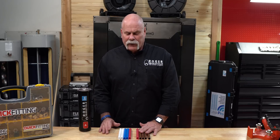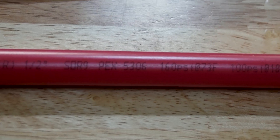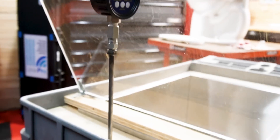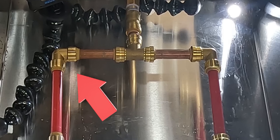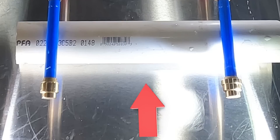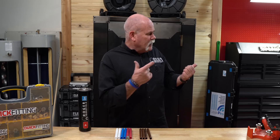The copper is already at over 1,000 pounds of pressure, and the PEX is rated at 160, so we're going to go way above that. We're not just wanting to test the pipe — we want to test two different brands of fittings and see how they compare. In our blast chamber we built a test rig. We're going to take a Quick Fitting 90 and a SharkBite 90, a Quick Fitting coupling, a SharkBite coupling, a Quick Fitting cap, and a SharkBite cap, then apply pressure and see what happens. Let's get all this put together and see what we can blow apart.